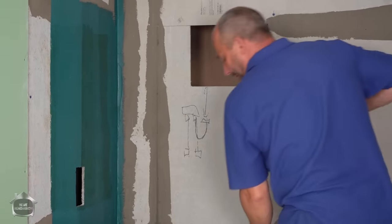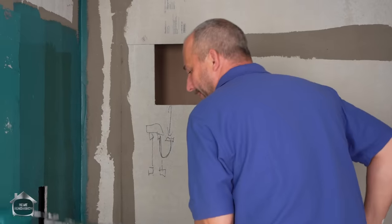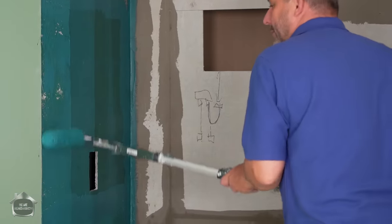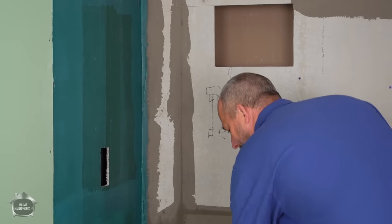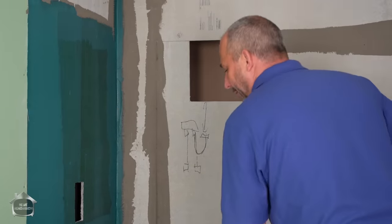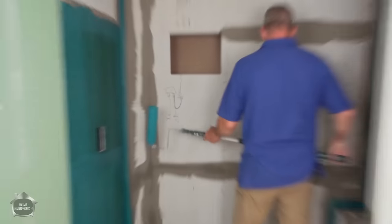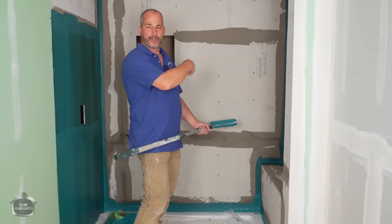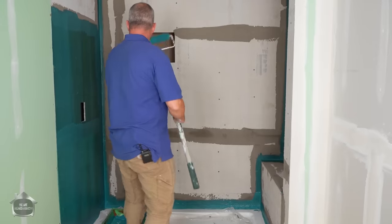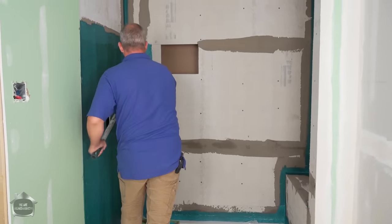And once the wood starts sucking up that moisture, it'll pull it through the cement, create a siphon, and start dripping on your ceiling. So really what we want to do here is protect the most vulnerable areas from absorbing water. And that is the bottom 4 feet and around the bench, so that when you're done your shower and you're rinsing off your walls and stuff, you're not allowing that water to penetrate and cause an issue.